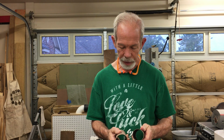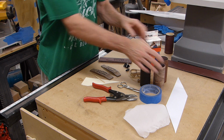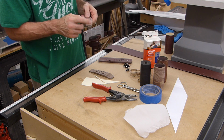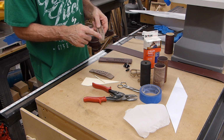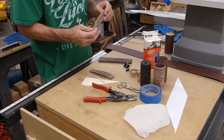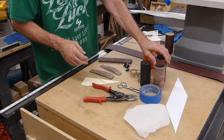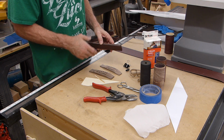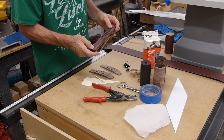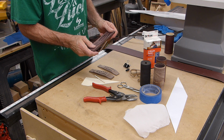These are the ones I've got. I think they're 80 and 100 grit. I need some finer to cut the wings on these guitar bridges for making this scoop. And it's a bit coarse with these. Too many sanding scratches. So now that I've cut the actual bridge out of Indian rosewood, these are walnut for practice, I want this to be smooth.